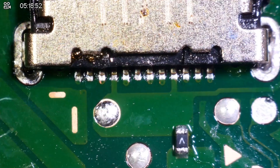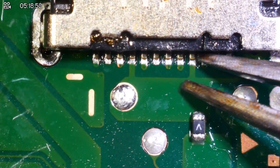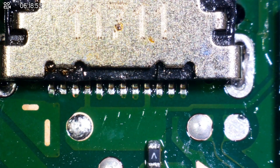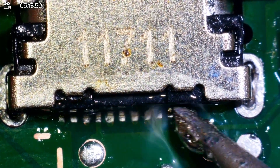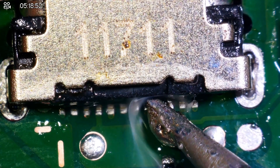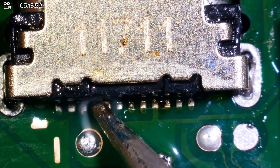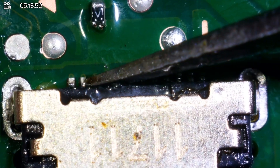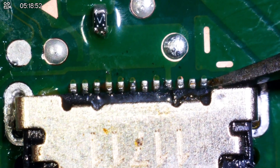Maybe they've made a little bit more of a connection now. Quick test with the tweezers — some of them yes, some of them no. So I'm going to get my soldering iron and just tin them. Now you can see how so many of them still move — they're still all really loose.